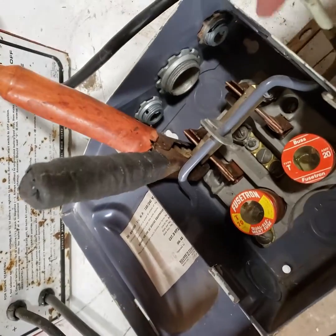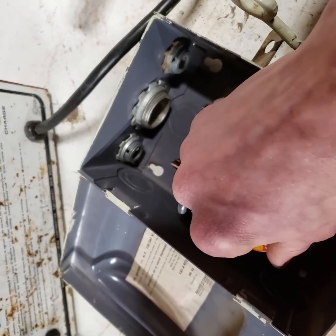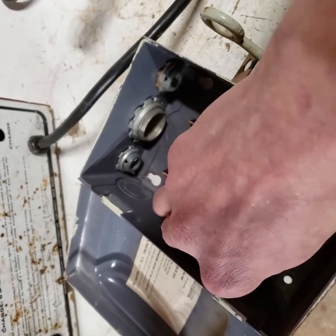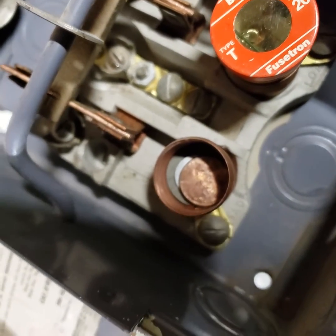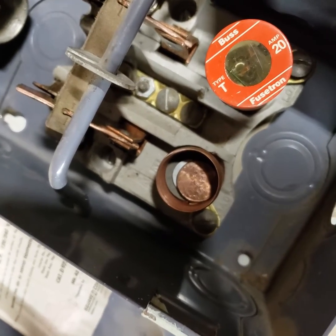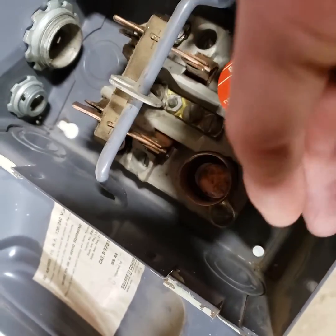...assuming this was on the wall or something, you take these fuses out — or say a blown fuse — and take the fuse out, and then you put a penny in there. That's why you get the name Lincoln fuse. It's not a fuse — it's more of a short circuit, basically just bridging the two terminals of the fuse.